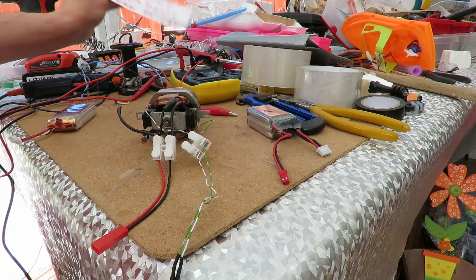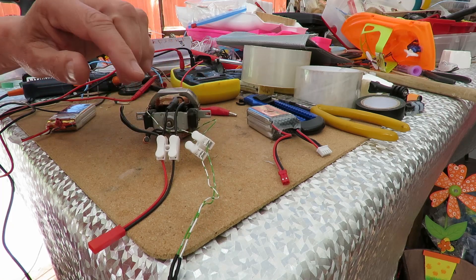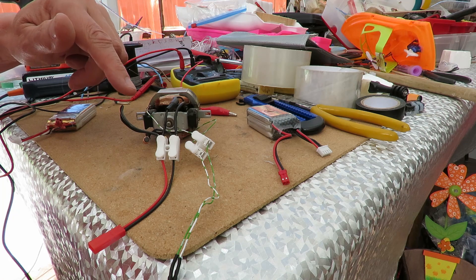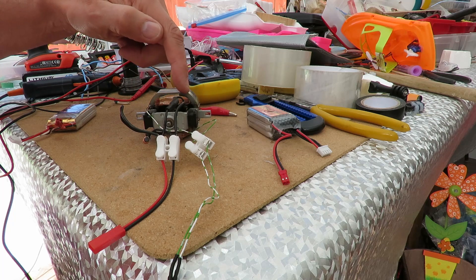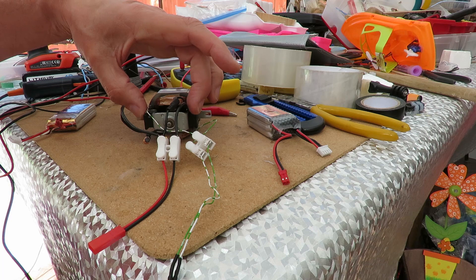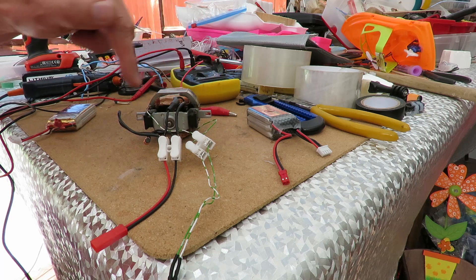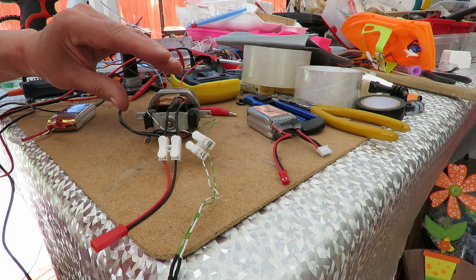Hermit Old Guy's suggestion was to put these two coils in parallel rather than series. With the original motor the power went in one wire, through the coil, out, through the armature, out, through the other coil — so it's all in series, so you had high resistance, which kept the power down because it reduced the current flow.